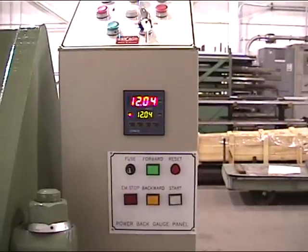There are the controls for the motorized back gauge. There are approximately 25 inches of travel on the gauge. It travels at 20 inches per minute. You have a forward and a reverse button, which can manually operate the gauge. You also have an automatic function, which will be a go-to positioning, by entering the number in the counter which you desire to back gauge to.